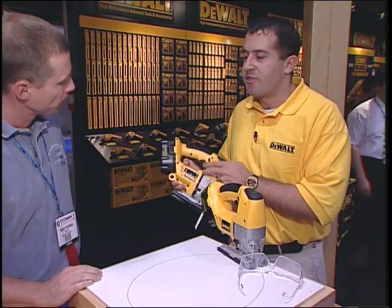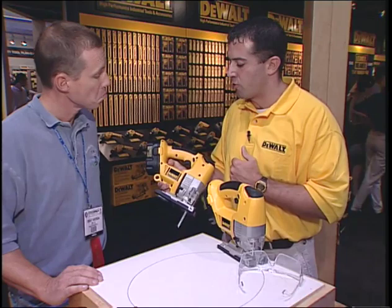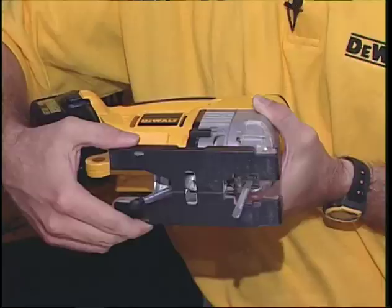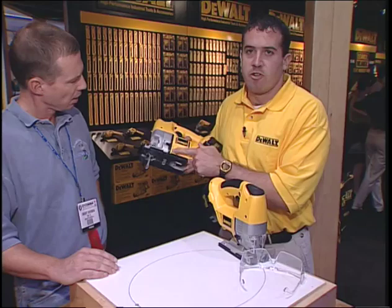Hey, that's a first. This 18-volt cordless jigsaw will cut through 100 feet of 3/4-inch countertop on one charge. Wow. That's four full sink installations. What else do you like, Mike? Keyless blade change. It accepts both T-shank and universal shank blades. A tool-free beveling shoe. I haven't seen one of those before. Toolman, it bevels both ways, 45 degrees. A dust blower. A three-position orbital action.